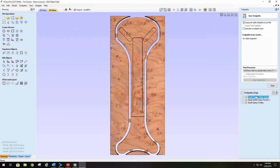To save your tool paths, you can combine things together. For instance, if you have something that has two of the same cutter, you can combine those files. In this particular instance, file 2 and 3 will be able to save together. Another thing that you really want to do is make your file names unique to this piece. And also, I always put a numeral in front designating the order that the files are going to be machined. That way, when I go to my pendant, it's a lot easier to see what's going on.